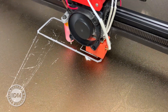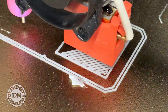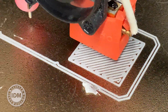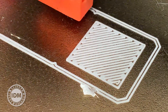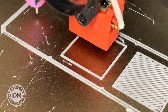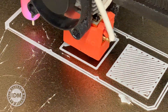It's off and running, but this is what I was worried about — the adjustments to line width are going to affect the distances of the first and bottom layers, and of course the top layers as well. I don't expect it to be amazingly smooth with the 0.8 nozzle, but I'm going to have to do a lot of tweaking to get those lines closer together. We'll stay tuned as it increases the line width for an optimum result.